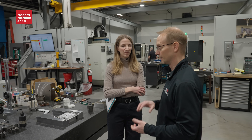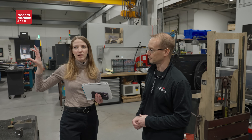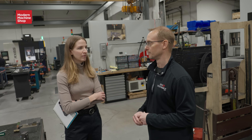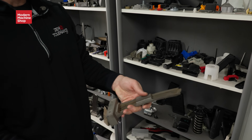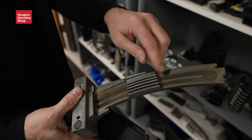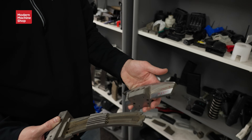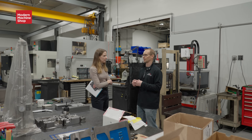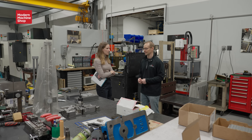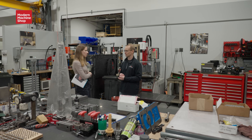The five-axis machines have been really helpful — when you don't have them you're afraid and intimidated, and when you have them you're like, how did I do it without it? Speaking of combining technologies, will you be machining some of the metal 3D printed parts on the five-axis or three-axis machine? Yes, we already have done that. We had some stuff sample printed for us, we were impressed, we were able to machine it and send it to the customer. Gun magazines with curved slides, conformal cooling circuits in stainless steel — the 3D printing does a great job, but it's not everything. So the goal is to bring it as close as we can, utilize that for overnight and weekend runs, bring it into our machines for the final cuts.